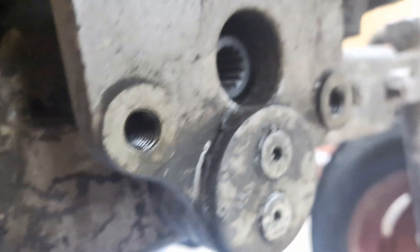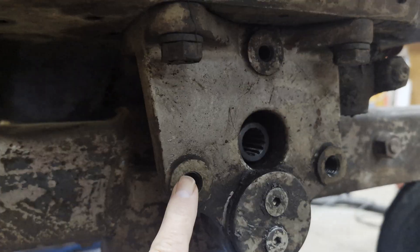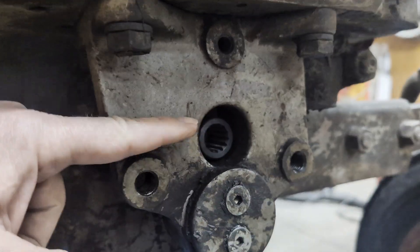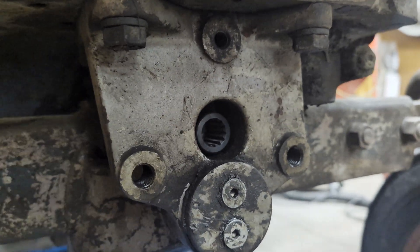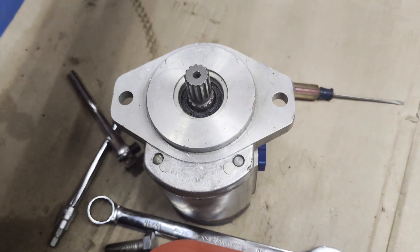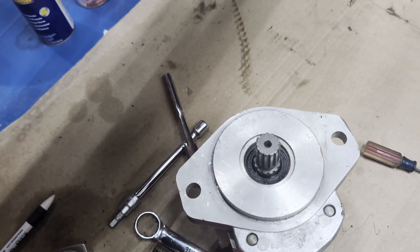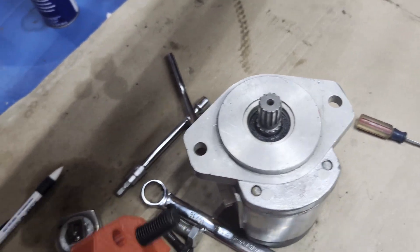The shaft isn't going to be long enough — it's made for the 165. The 65 has these three mounting points and unfortunately they're not coincident with the center of the shaft, which sucks. All the pumps out there these days seem to have the mounting points coincident with the shaft, which frankly makes a lot of sense. So I'm working on making an adapter.